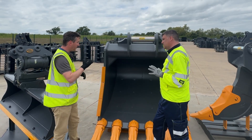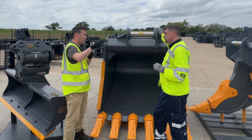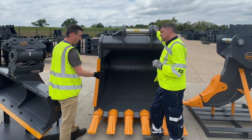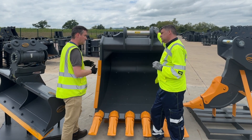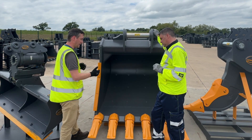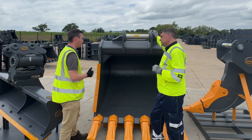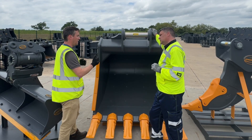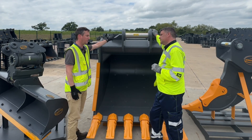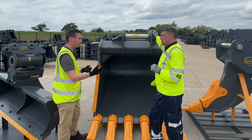That's a really hard application. Listening to our customers, we looked at the teeth on our bigger buckets and what we went for was Esco U45s — which people might say isn't what Strickland always uses — but we listened to them, and that's what they preferred on their bigger rock-type buckets. We also put weld heel shrouds on it. And depending on your host machine and pin, we try to keep a 90 mm, 100 mm, and 110 mm pin version of our rock buckets here on site for immediate delivery.